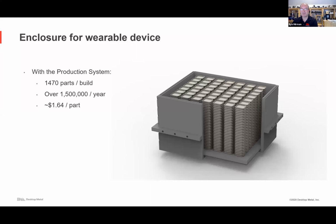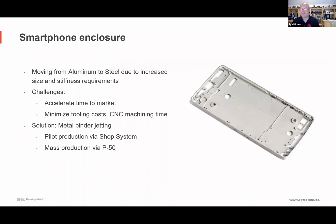These parts previously were too complex for forgings, and so metal injection molding was the primary way, with a ton of post-processing. There's literally factories overseas. The labor doesn't make sense to do it in places like Europe or North America. But you have factories where these parts are MIM'd and then post-processed. And now instead you can make a near net shaped part right in the production system.